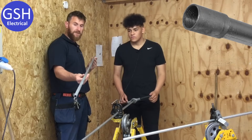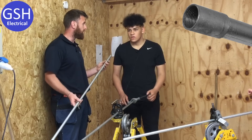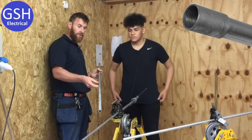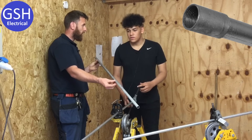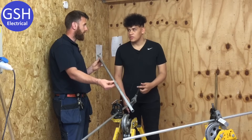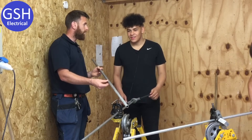And the length of the conduit? 3 metres and 3.75 metres. Why do suppliers now supply it in 3 metre lengths? Because it's easier for transport. Easy to transport. The finish on this particular piece of conduit — can you remember what that's called? A hot galvanised finish. And what's the purpose of the galvanised? It stops it from rusting and decomposing — corrosion. And the other finish is?